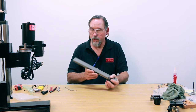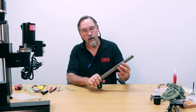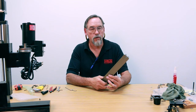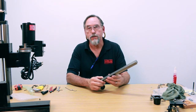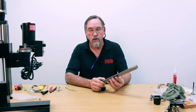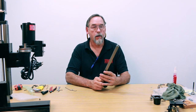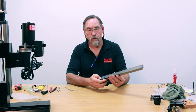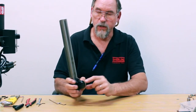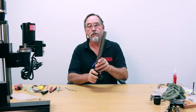This particular bed is our 15-inch bed that has the nickel and Teflon coating on it. The Teflon adds lubricity — it makes your Z axis slide up and down a lot smoother. The nickel makes it rust-proof, so it won't rust in a humid area or with fingerprints. If you buy our ball lead screw mill, this is the bed we put on. When you assemble it, make sure the adjuster notch on the ball nut or arm mount is facing up, so you can indicate this back in again once you've changed it out.